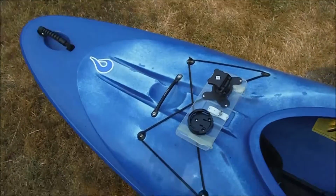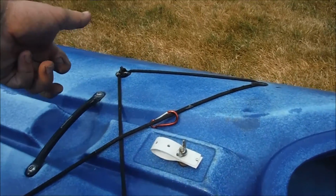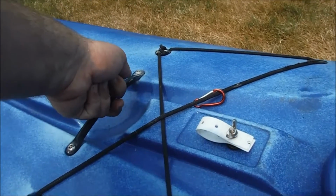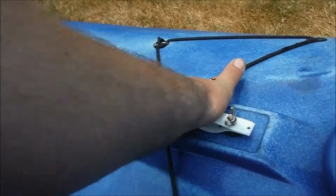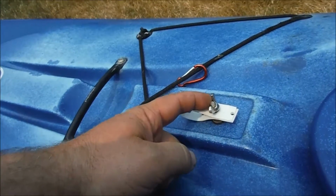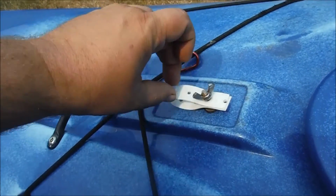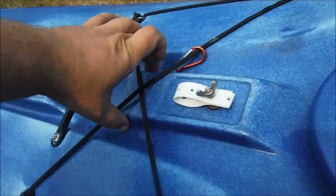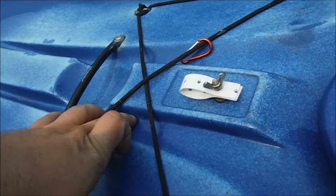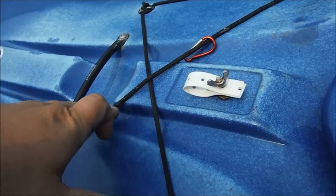And what my plan is to build an assembly that's got a hook that goes onto this rescue point. So it'll hook on like that and then fold down and go over this bolt. This is my standard quarter 20 camera mounting bolt. And so that'll give a rigid backbone here, and then have two pieces that go down into these grooves, and I'll just cut some material that fits into those grooves.